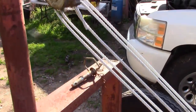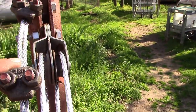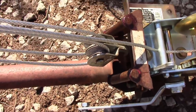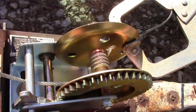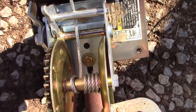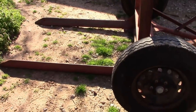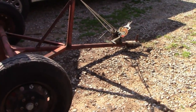I'll show you what I've got here. You can see here is the anchor point. Cable is running down, going into the next block set right here, and then from there onto the winch. The manufacturer recommended at least four wraps at the end. What I've done when I rig this — I set those forks down. As you can see the forks are completely down, and I've got four wraps left on that hand crank.